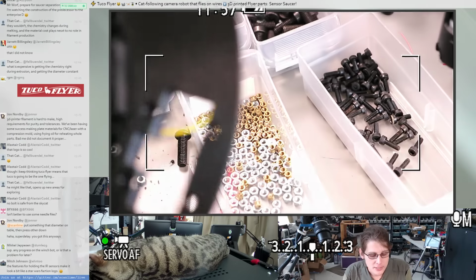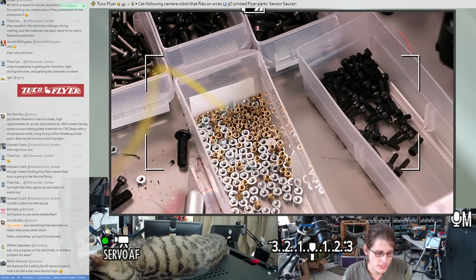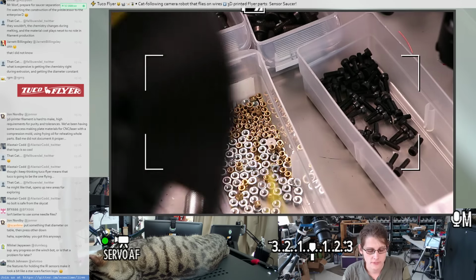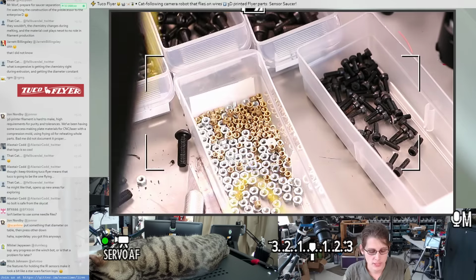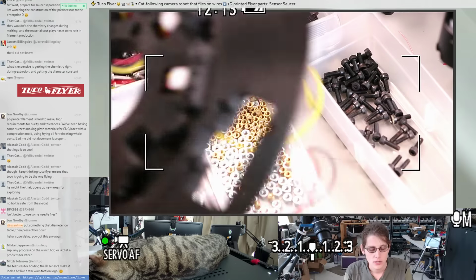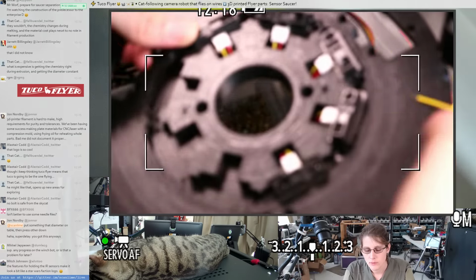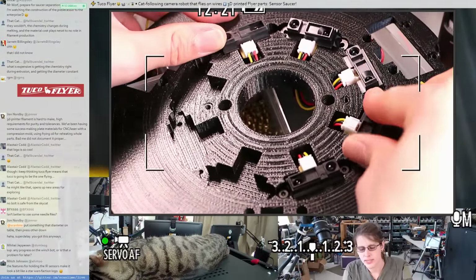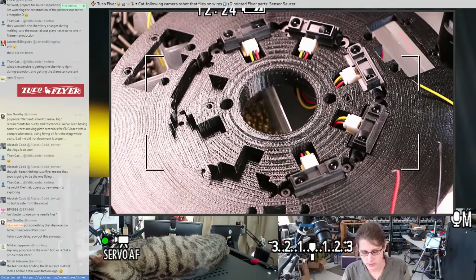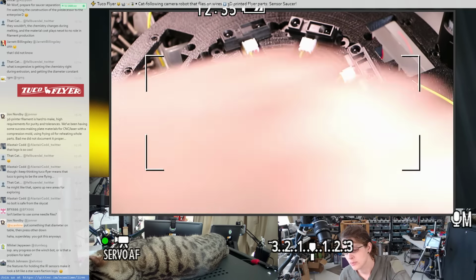It would be easier for a coupler to just make the whole thing way bigger. So if I can fold part of the coupler design into the spool, then I think I can fix that. But then it makes supporting the spool sufficiently a little harder. I think there are a few ways I could support the spool. One kind of novel way is to roll the spool around on bearings, but then you end up having a bearing on plastic rolling interface, which is maybe fine, but maybe a source of wobble and noise problems again.